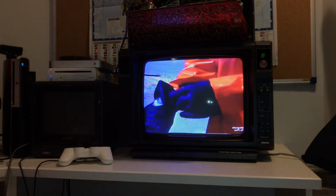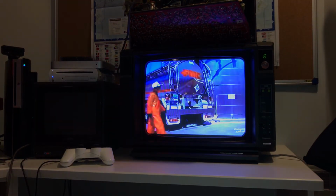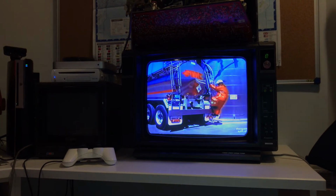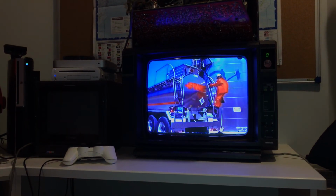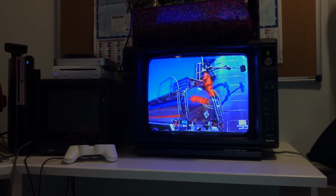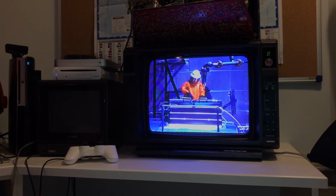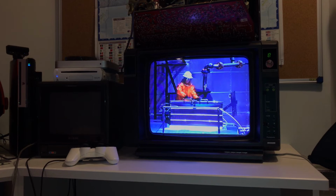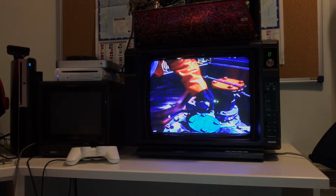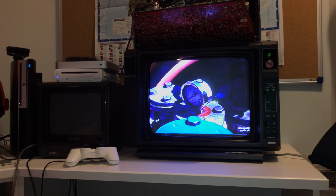Hard hat to PVC or rubber-protected steel-toed boots. Although our driver technician will be unloading the truck alone in these scenes, we require a second person to stand by for safety and for confirming that the product was delivered intact. She's checking the tank pressure before making any connections. The gauge is behind the plumbing in the dome.